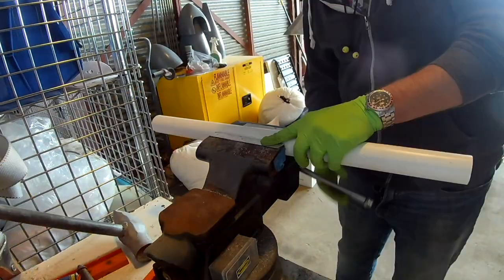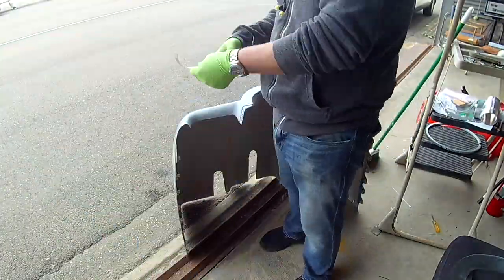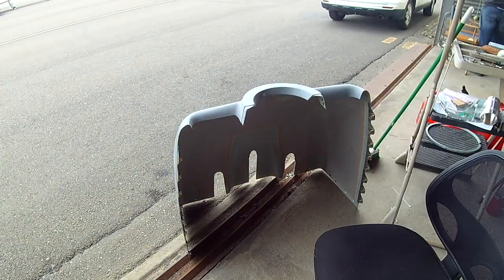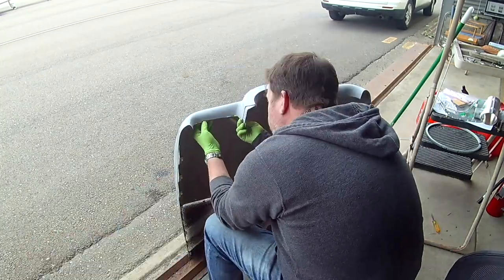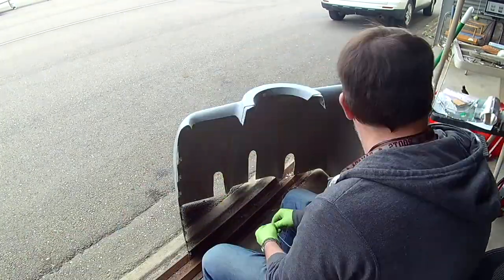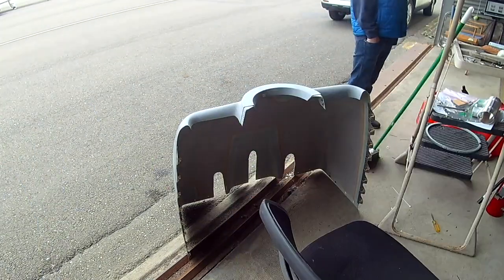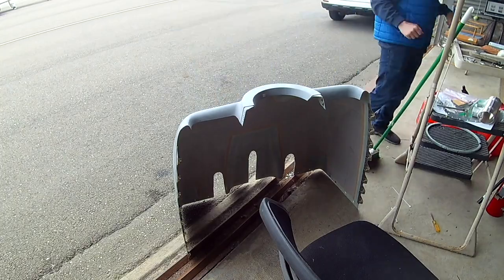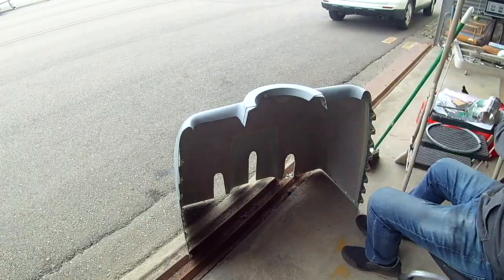The idea being that there's going to be a piece of baffling rubber on the back side of those air inlets, and as they stick backwards — because they are spaced just right — the baffling material will easily glide over the engine baffles themselves and sort of provide a seal. That way, as air enters it cannot go between the baffles and the cowling, and instead goes directly either into the air intake on the left side or over the cylinders to do the cooling, which they are supposed to do.